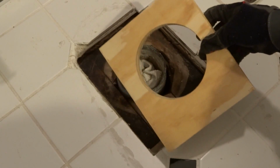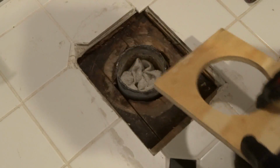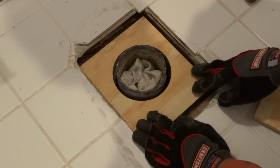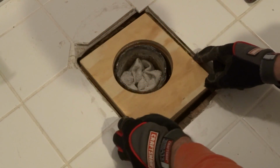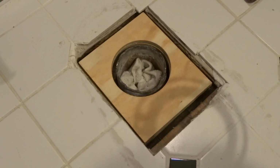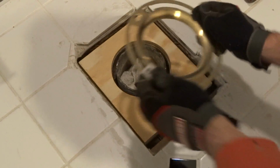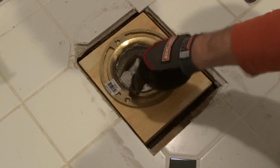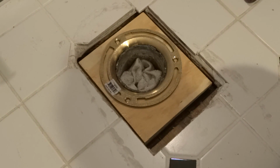Now we're going to take our piece of plywood. In this case, it's 9 by 7.5, which is smaller than the hole, but really, I just needed to get it in there easily. So I'm going to take the 1/2-inch piece of plywood and drop it on top. You can see the hole is larger than the actual pipe because I need to get the flange around here. I'm going to drop my second piece down. Now I've got 1 inch of filler that I can bolt down. And then finally, I'm going to use a different flange that has more throat to it, but this will go on top. Mount the flange with these 3 bolts. I can slide my studs in there and bolt my toilet down.